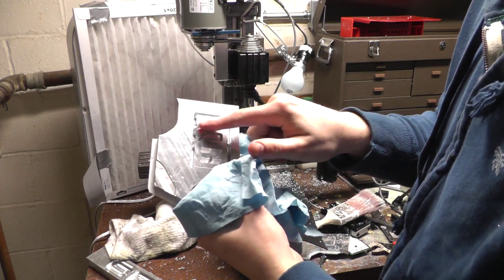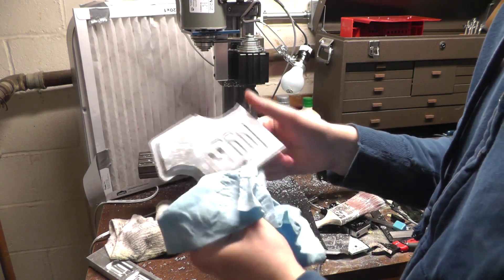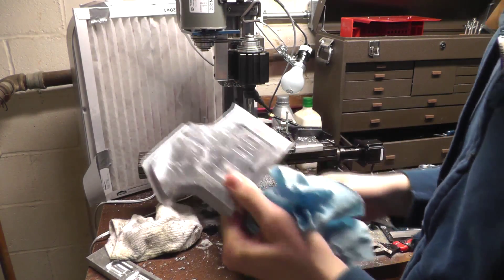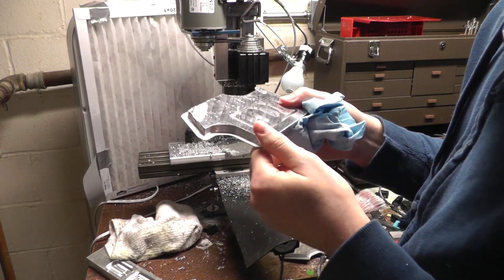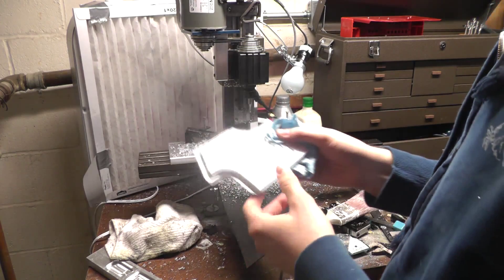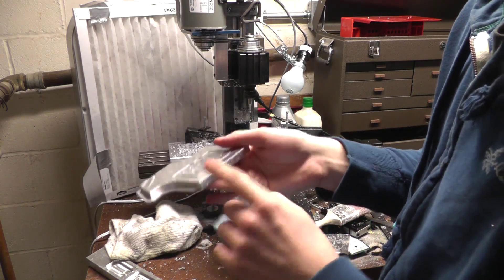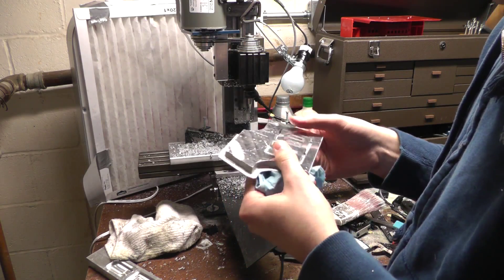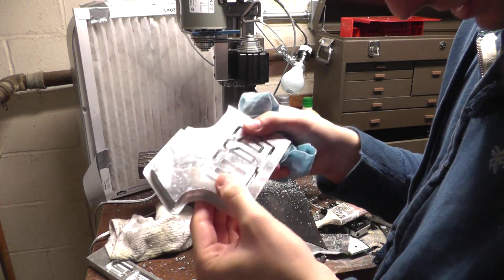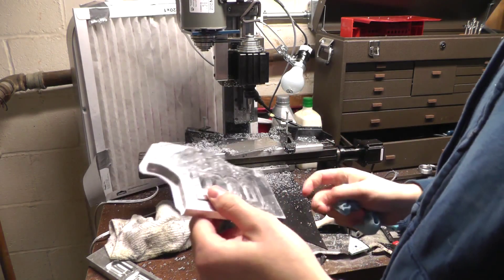This is the profile cut. These pieces inside actually aren't meant to be there — I probably could have set that up as a pocket, but it was easier just to set my outline and go. I'm not sure what happened down here. I could see the chips changed towards the end. Either the mounting moved, which is very possible, or it got too high on the end mill and started getting into the taper, which may have run into the walls. I don't really know, but I almost got that H all the way through.